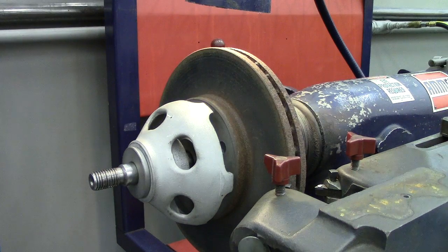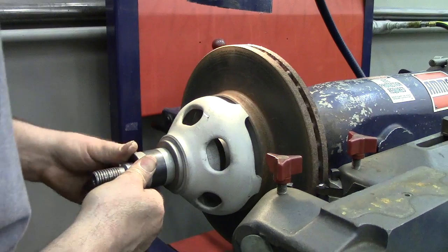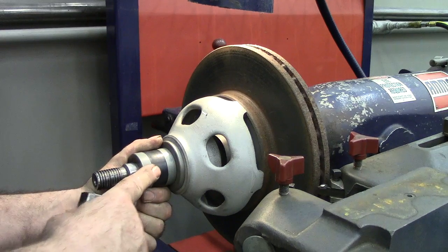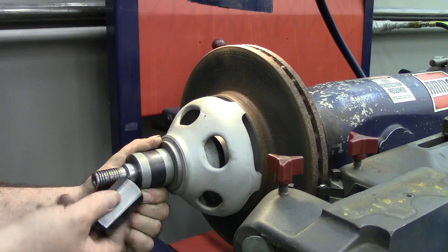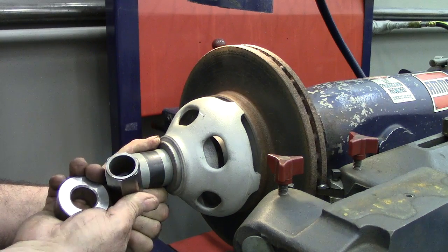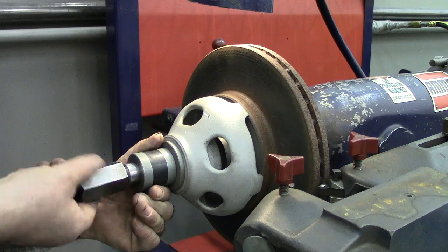The clutch and the nut might be enough, but I might also need a spacer. And again, we could have used the ball bearing units, or we could use a regular spacer. In this case, all I need is the clutch assembly, the self-aligning unit. It does leave this much shoulder. We say, well, wait a minute, the nut won't go down past those, but what if I use the part that's counterbored out? That can make up that space.